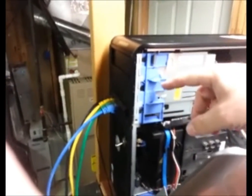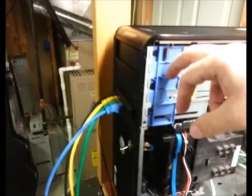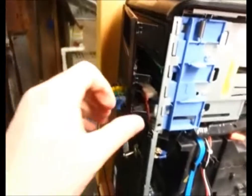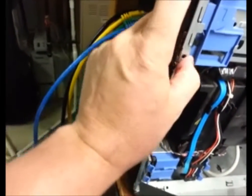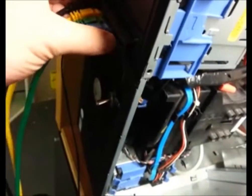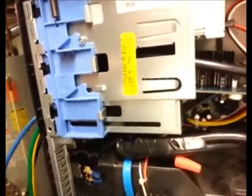I got the idea from another small manufacturer of CNC kits, and essentially what is happening here is they're using Cat 6 cable, and all I did, and I don't want to open it all the way up because it'll kind of come apart, is I ran a punch down keystone from there. It's inside there, and it's running to the individual ports on the punch down, which is on the front of the TB6560, the 4-axis CNC controller. The controller itself just sits in there with the DB25 cable coming out the back, and then running out and back into the cabinet for the parallel port.